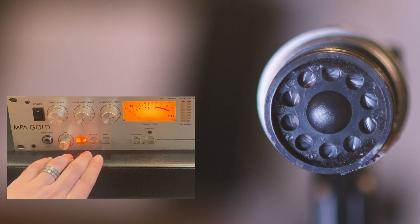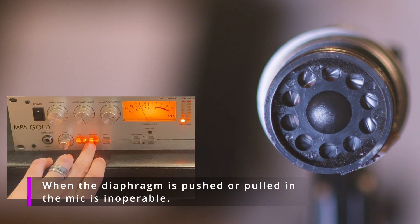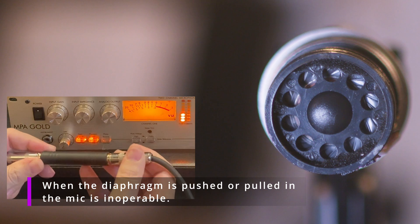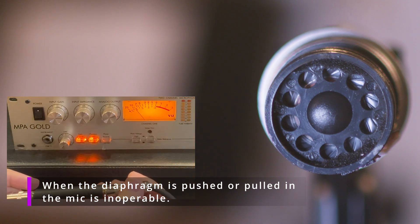Now, last scenario — probably never going to happen in a studio, but let's see what it is. What if we have an unbalanced mic with no transformer, meaning one side of the capsule will be getting phantom power and the other side goes to ground? Exactly what we would expect. The diaphragm pushes forward, or backwards, depending on how the mic is wired — and this is like putting a 9-volt battery across speaker leads. After all, a dynamic mic is just a speaker in reverse. If we add direct current to a speaker, it moves in only one direction and doesn't come back to zero. However, when we remove the voltage, the diaphragm goes back to normal. Even though the mic was maxed out, it still works. Again, not something you want to do very often.